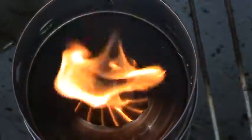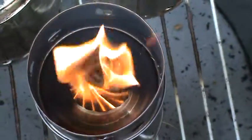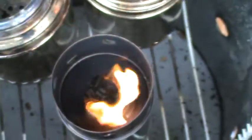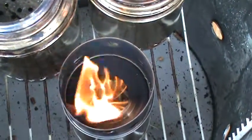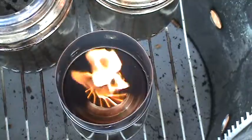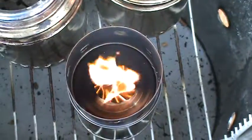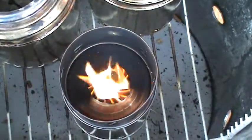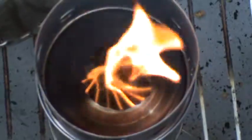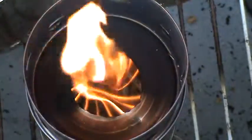It's gasifying but with a yellow flame for the most part. What I expect is when it burns out there will not be smoke. It seems like a trade-off: you can have a nice blue flame, but blue flames tend to not only smoke but also leave a lot of wood pellets still intact in the bottom that don't get burned out. So if this behaves more like the other 5-to-1 ratio stoves, it should do a good job of burning out all the pellets and not smoke at the end - the only difference being no blue flame.